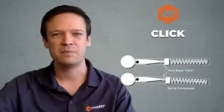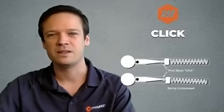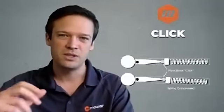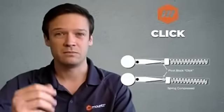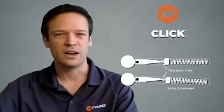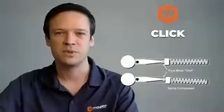When you keep in mind that the pivot block is where the torque action is taking place, let's think back about what is torque. Torque is a force times a distance. So that means that this distance is also going to have implication on the torque delivered by the click wrenches. What that means in the real world is that the position on which the click wrench is held is going to change its torque delivery. So of course, that's important because when using click wrenches, you need to make sure that the operators are aware of that and that they always use the click wrench, holding it in the right position.